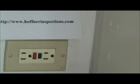Old houses, if you don't have these, very good idea to update them. Very inexpensive. They cost about 15 bucks. Easy for someone to wire them in that knows a little bit about electricity. They'll save your life. A standard outlet, if you're getting a shock from it, it won't shut the power off. You'll stand there and fry all day if it doesn't trip the main circuit breaker. These GFI outlets will instantly trip, and they'll stop you from probably getting a shock and will save your life.